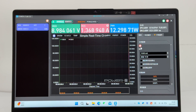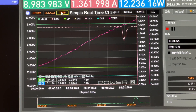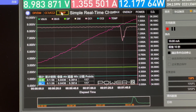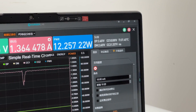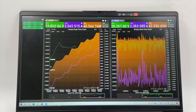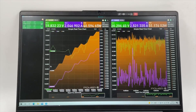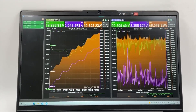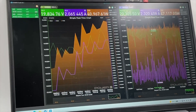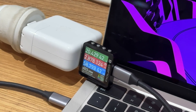The last function is the powerful PC software. As mentioned, it supports data reading, recording, and exporting. It can even trigger protocols, adjust voltage, analyze PD protocol, update the firmware of the tester, and more. It can connect multiple testers at once — theoretically with no limit on how many devices. It currently only runs on Intel-based Windows 10 and 11, and the macOS version is still in development.